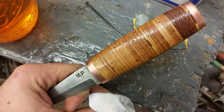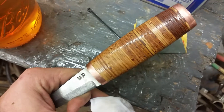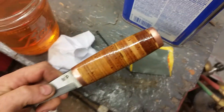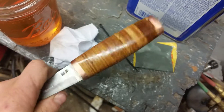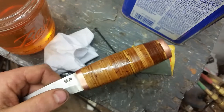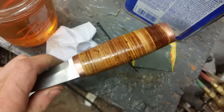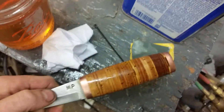Now where the higher spots were that I sanded down, we'll put a light coat of thinned tung oil on it. We have another light coat of oil — we're going to let this set up, continuing what we were doing yesterday, but instead of dunking it we're just going to wipe it on. Let that build up and smooth out and it'll be looking good soon.